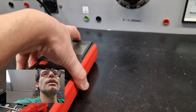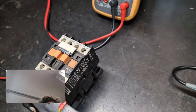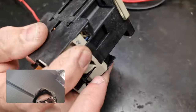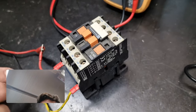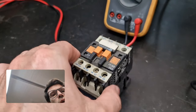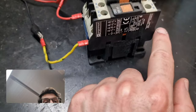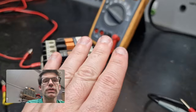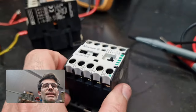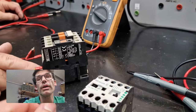Now — how do you switch on a contactor? It's easy. Contactors will have an A1 or A2 marking, or another symbol. Sometimes it won't say A1 or A2, but even if the labeling is washed away you can always identify the coil at the bottom of the contactor. Looking from the top, the coil is always on the far bottom side. There are many different types — you have to make sure the coil terminals are in the same place when replacing. It also shows the voltage rating.